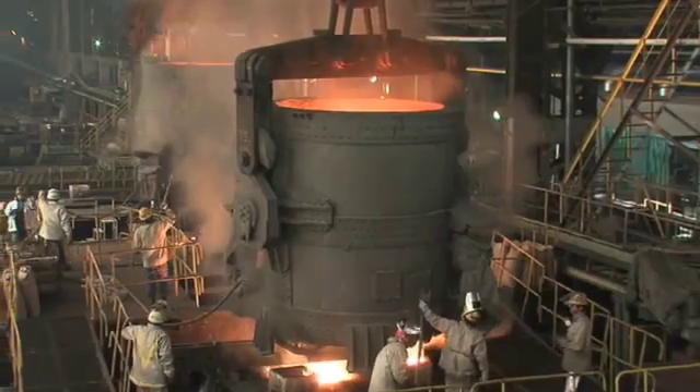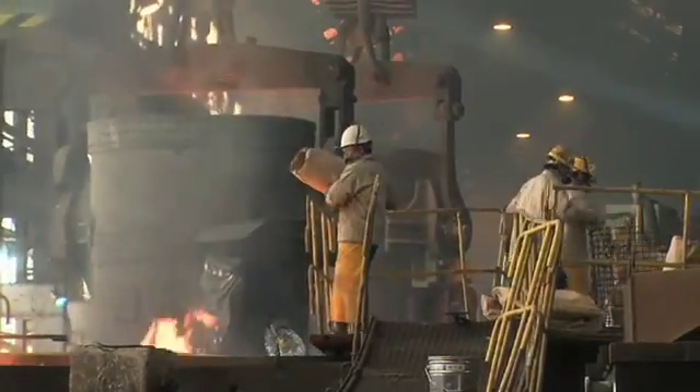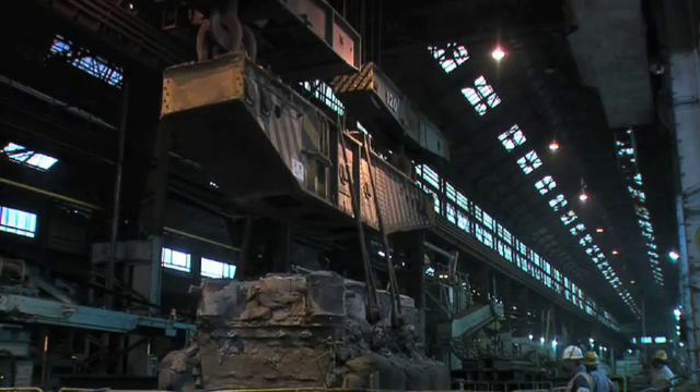The cooling process is carefully controlled. Rice husks are placed on the poured steel to help slow the cooling. After cooling for about a week and a half, the saddle is ready for removal.